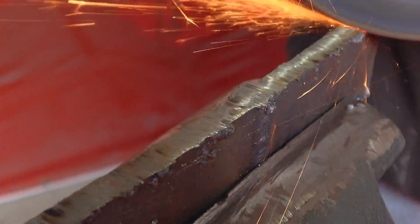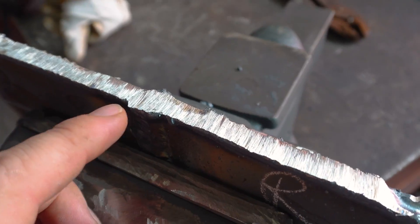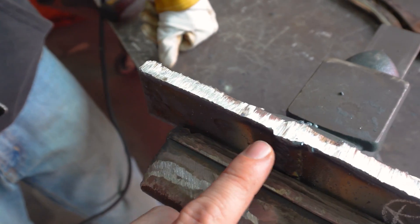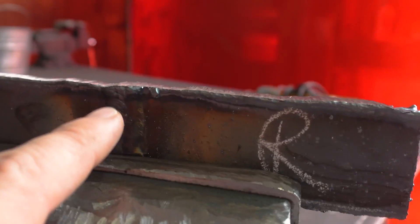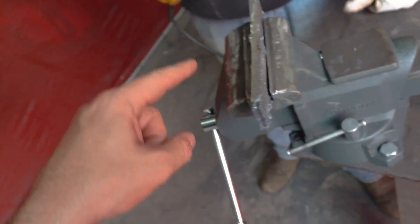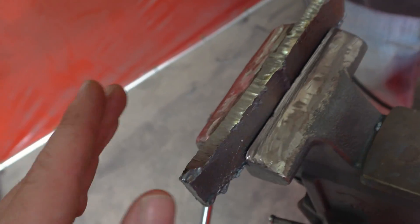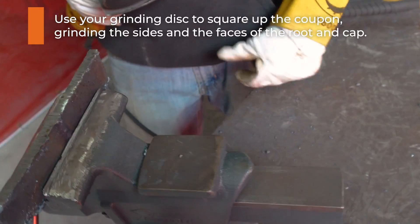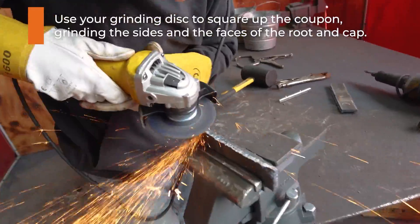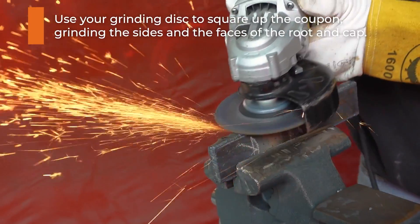If you notice you're getting to that line and you're going to take away from the width, stop grinding and deal with what you have — it's got to stay that way. The end of the strap — just touch it lightly with a grinder, they're not going to worry about that end. It's closer to the weld zone where they're going to get a lot more critical. Be careful of any bumps right next to the weld — if the grinder digs right there you're taking away from the width in that critical spot. Single strokes across, get the roughness out.